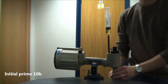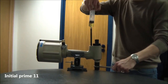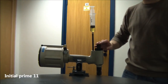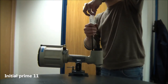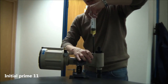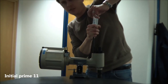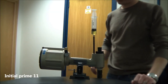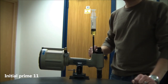Do the same with the second half of the stroke. With the head piston fully forward, you can release and no longer need to put any more pressure on the syringe. What we're going to do now is seat the floating piston against the air piston rod — this will require a reasonable amount of pressure. You'll feel the piston hit the air piston rod and hear a small click when you do it. That click means both pull and return sides are full of oil. You can then remove the return stroke setter, remove the priming syringe, refit the bleed screw with the dowty seal, and the tool is primed.